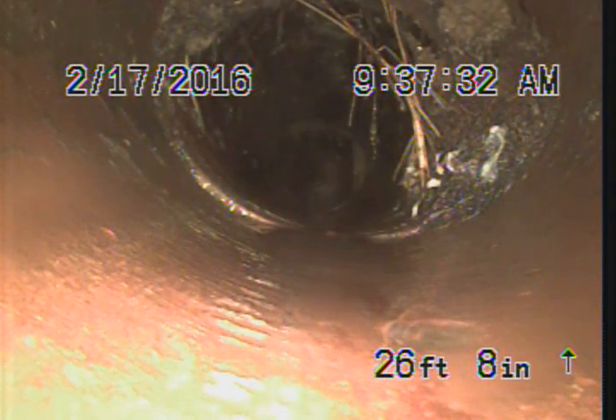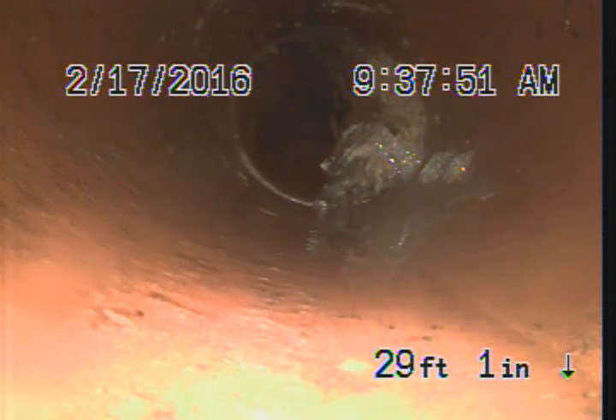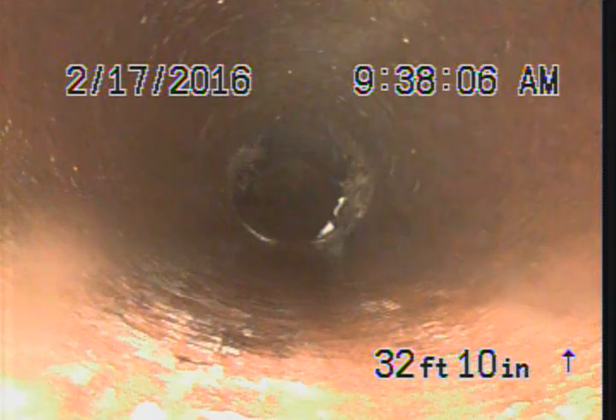We're still not into the main, are we? No, we're in your side sewer pipe. So we're going straight out to the end here. We've got some roots here. It's got a little bit of laundry detergent or some sort of detergent. You should be now in the main coming from the back — you're in the main side sewer, your main drain, but not the sewer main. We're definitely in the main though, because you're well beyond where the problem was.